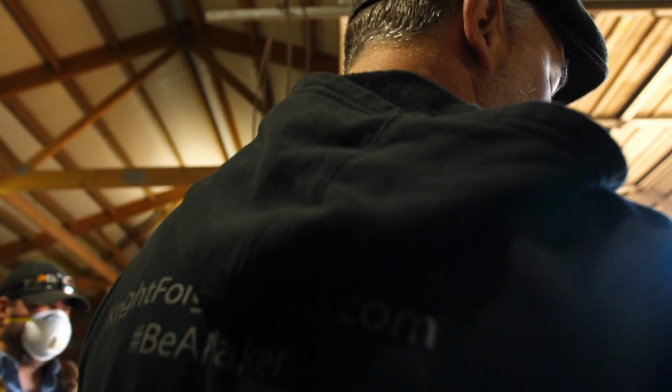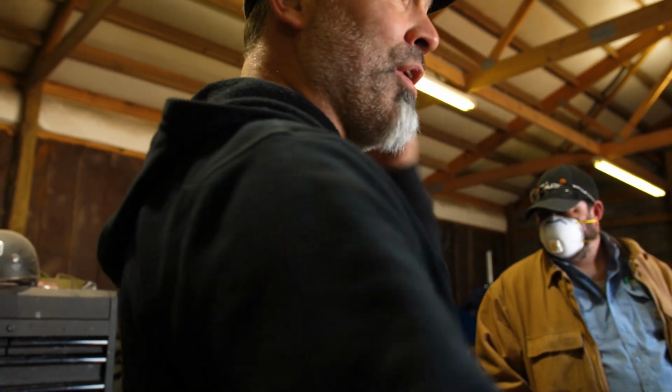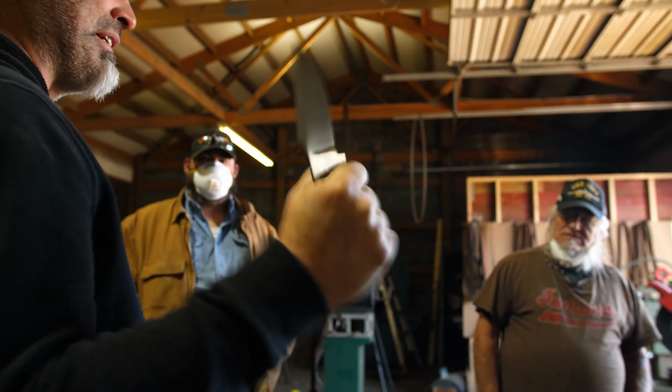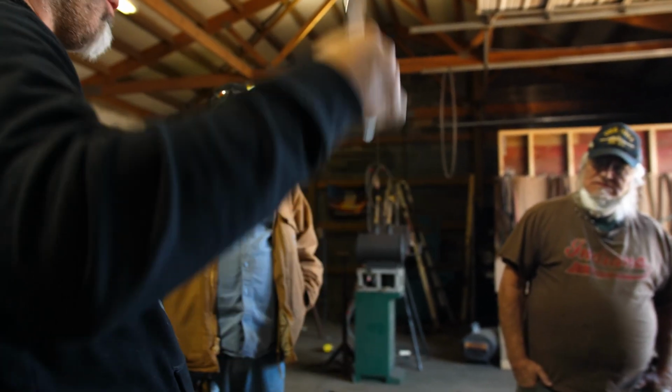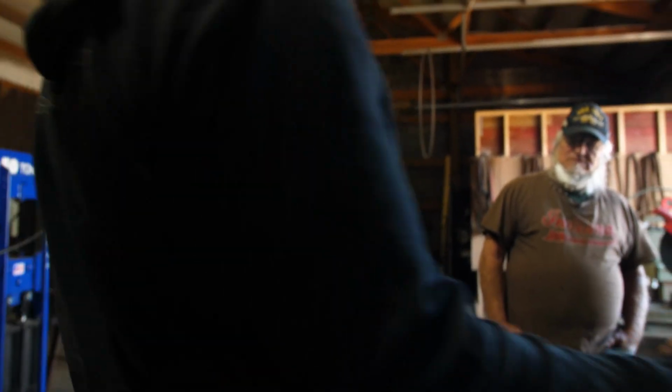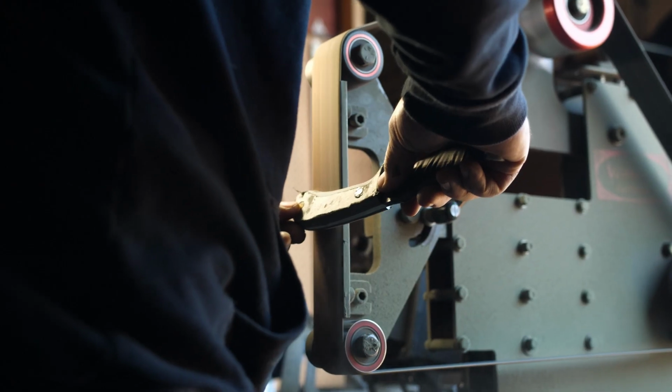All right? I do it the same way when I do contoured handles. I don't know if we did that on yours. Did we do that? I might have gave up on that for a while. Because sometimes I teach it doing the swoopy Marilyn Monroe Coca-Cola bottle shape. That's really comfy, but you don't do it on little knives, because you're not holding them that way. Choppers are nice that way because your hand's moving around and it gives you really good reference points, but when they're smaller knives, it's not a really great idea to do that on a small knife.